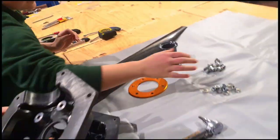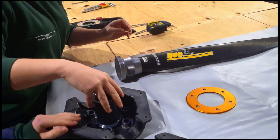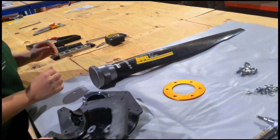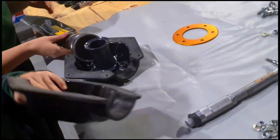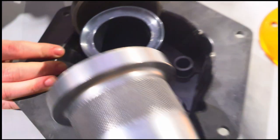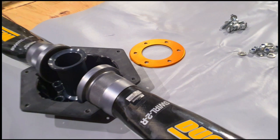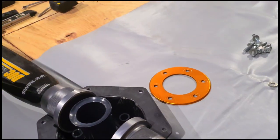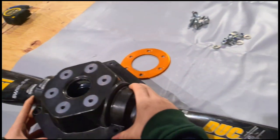So we've got the hub. Make sure we put the middle bit in — the spacer goes in the middle and needs to sit in correctly. Now we need to put the prop blades in roughly. It's very important to realise that the large holes go against the prop flange and the smaller holes go away from the engine. They've just roughly placed them in there, and they're going to put the hub on, making sure they align the serial numbers of the two hub halves.